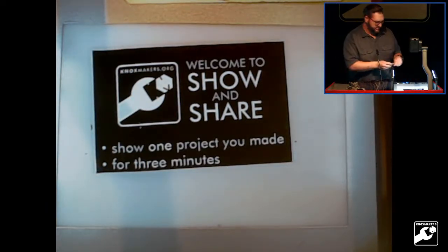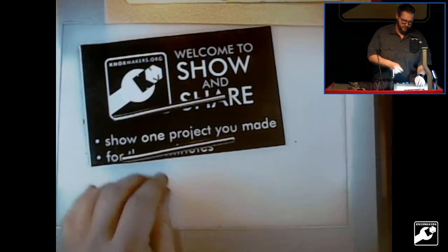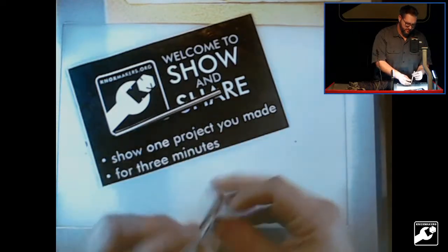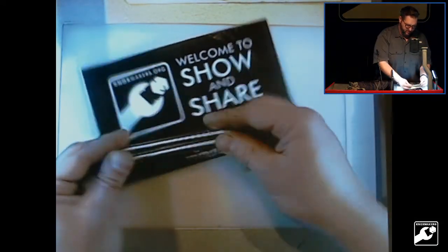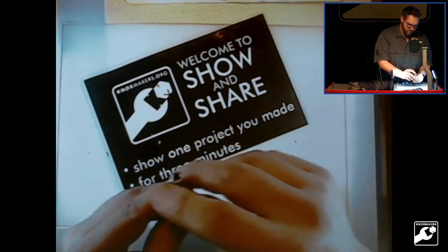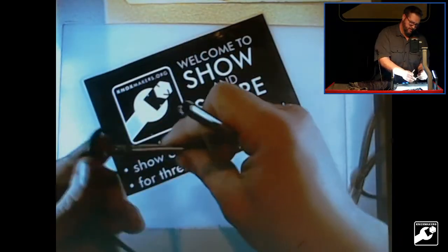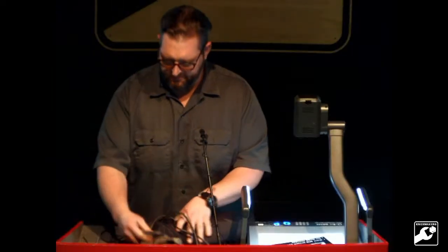And then I've also made some toggles to go along with it. So you have a strap that goes around the tree, and you could use a carabiner, or you could tie a marlin spike hitch and put a toggle in there. This is just stainless steel tubing, about 8 millimeters. That hopefully will support me. And gravity always wins. It's heartless. So anyway, I cut these down on the lathe and smoothed them off. You'll tie your knot on the tree, and then the toggle goes around the knot, and then you hook this over top of it. And that's what connects this end to the tree. So, short and sweet. If you have any questions, feel free to hit me up or ask them now.